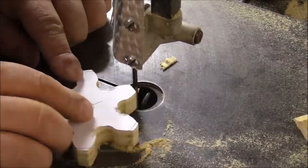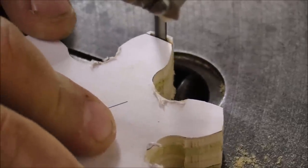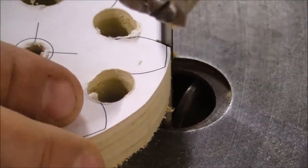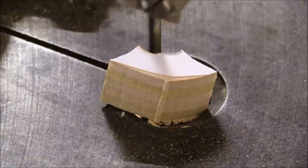Whenever you're cutting gears out on the bandsaw, always cut a little bit larger than the diameter. That gives you wiggle room when cutting out the teeth. I'm being very careful about where my entry point is, just skimming that line and taking it away — in my experience that's the best fit for the gears using Matthias's program. Then I come back around and do the same to the end of the teeth, just cutting off the line and leaving everything else.